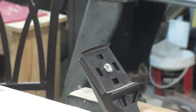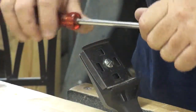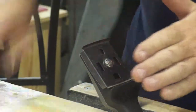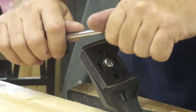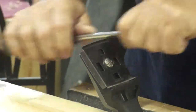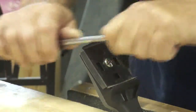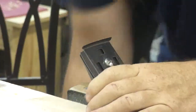Put you in frame. And I will burnish the tool with my burnisher, which happens to be a screwdriver shank. I wanna barely fold this. I wanna mushroom the edge over. I don't wanna go too severe, because you'll fold it under real quick and you'll be dull and you'll wonder what happened. Okay, there's a good burr on the bottom. I'll show you how it cuts.